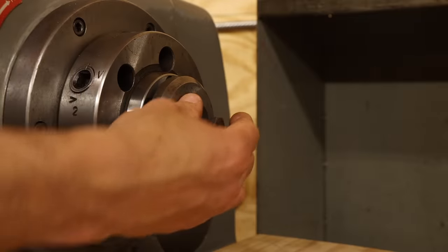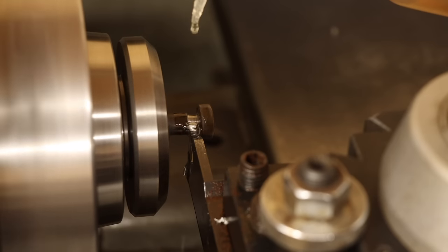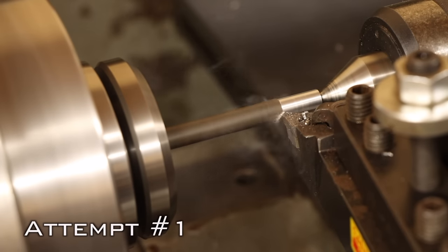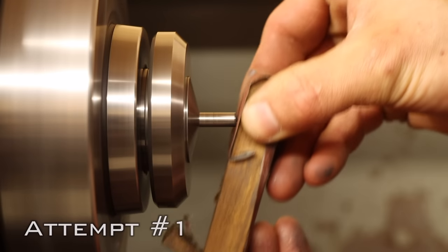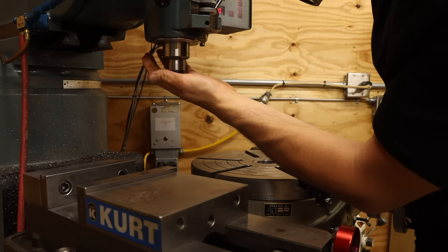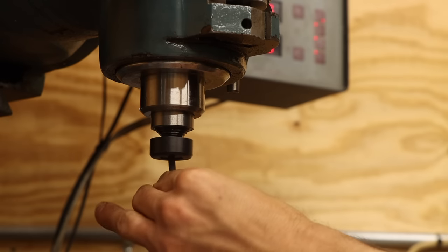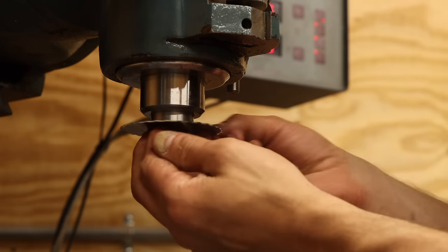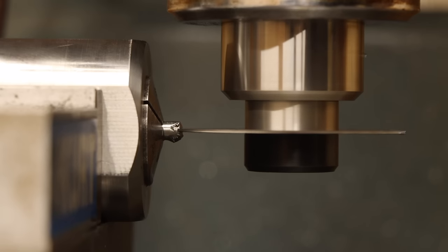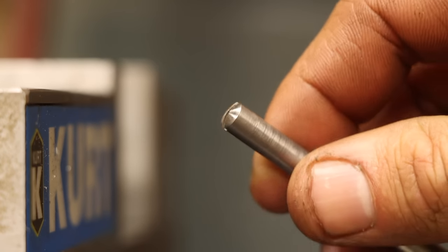I'm anxious to see how the fine adjust arm will pivot in the base, so we'll start with the pivot screws. That is the bolt I'm turning down to make a smaller screw. The easy way would be to use something already threaded for this, but I just can't bring myself to take this shortcut. This blank I've turned down is long enough for both screws that I need to make. Before I cut the threads, I'm going to slit each end for a screwdriver, using a slitting saw — a new tool in my shop that I've never actually used before.